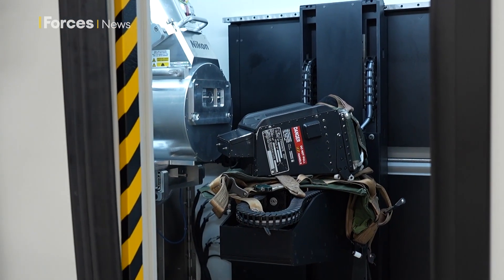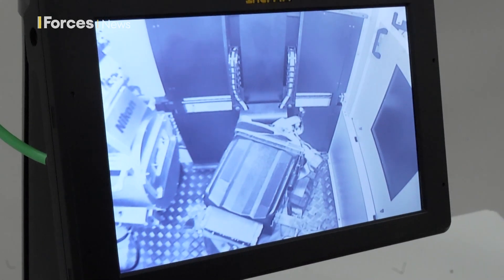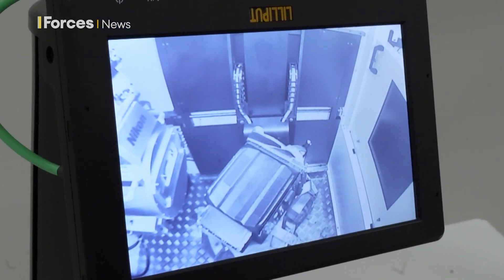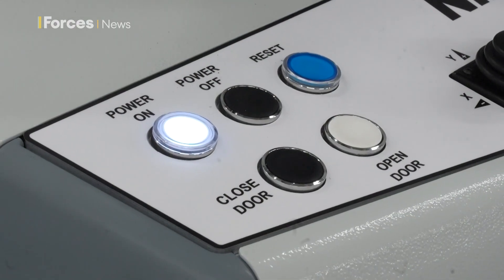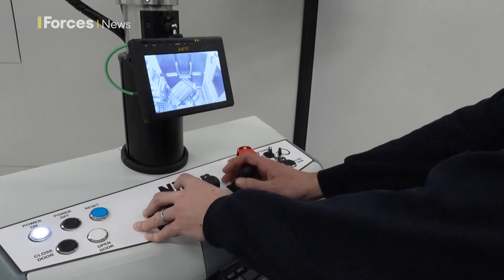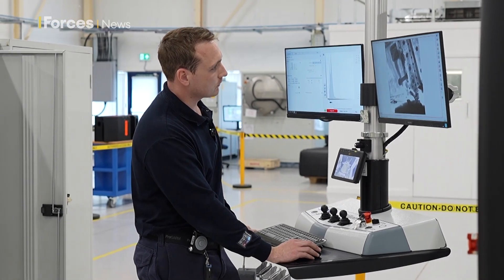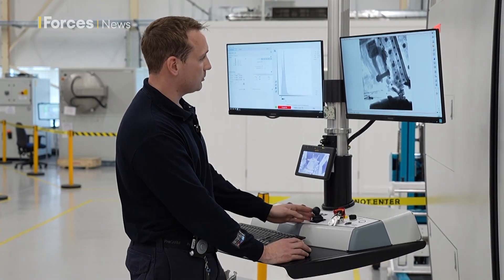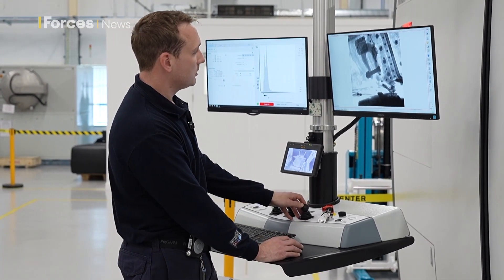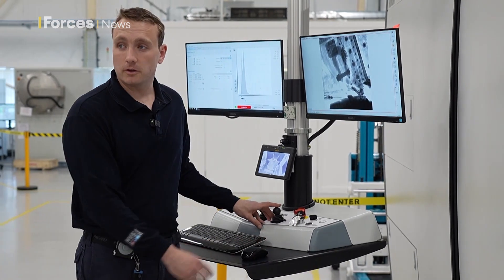This is realistically the best way to do it without dismantling everything and putting it back together again. I'll move over to the conventional 2D radiography mode. We have the freedom to manipulate the component whilst x-rays are on, which means we can find the thing we're looking for without having to go in and out of the machine — which we would have to with our conventional 2D radiography method. A process of just a couple of minutes, and we can check the integrity of that component and verify that these bolts are fitted safely. I can rotate this as a live image. Are they fitted safely? Yes, on this component it is fitted safely.